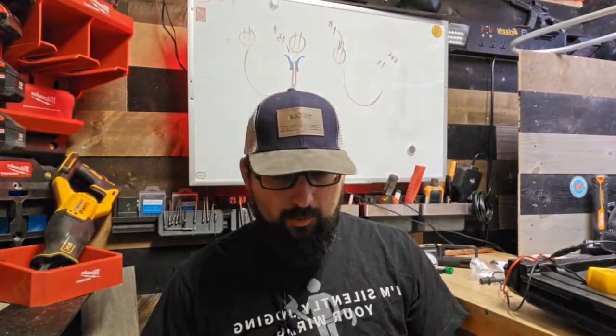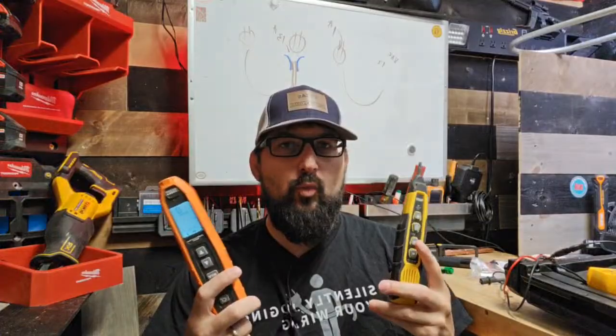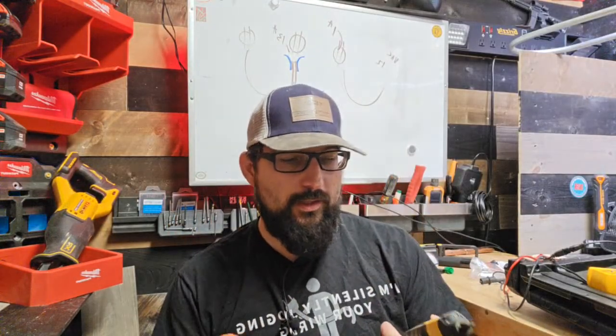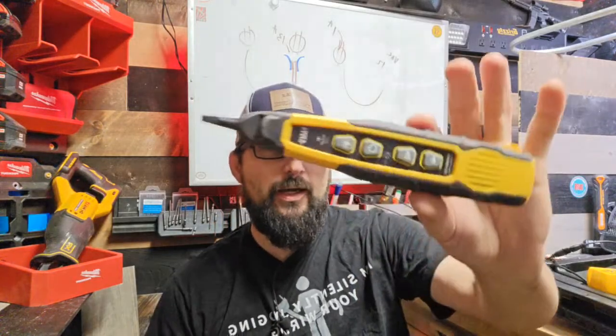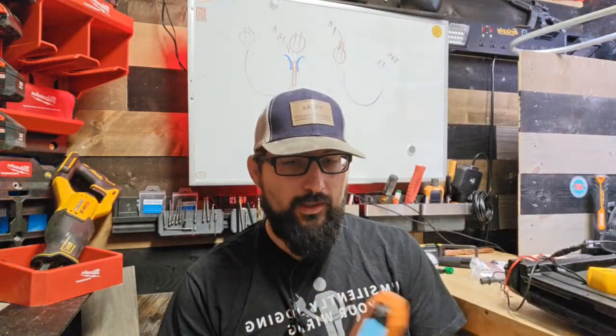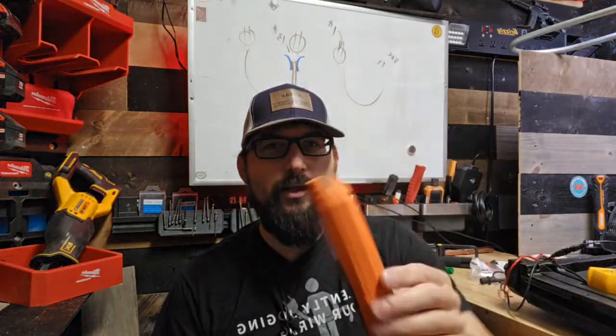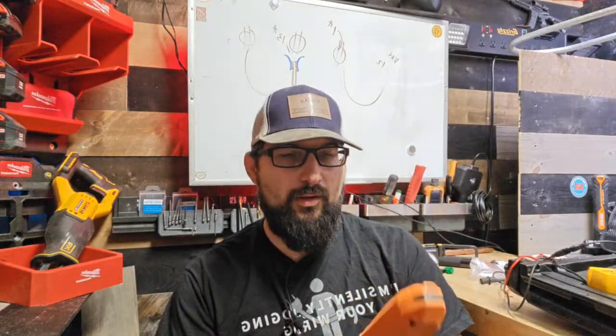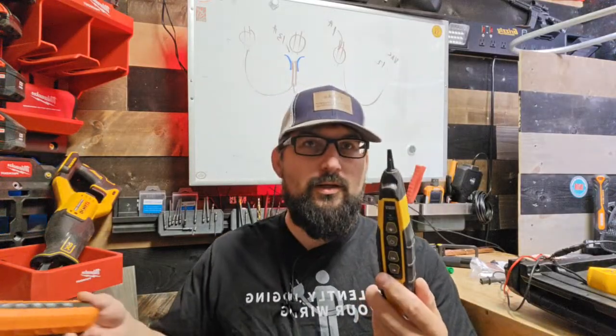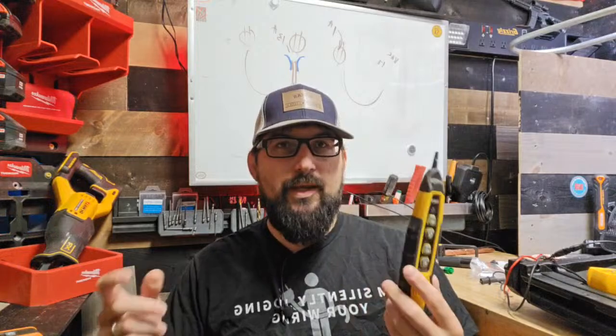So somebody asked a question today, which one to get? And the answer is, as a professional, you need both of them. This will get you by in residential for most of your career. This you're going to need if you're doing commercial. There's no doubt about it. Clamping to energized circuits in a crowded box and being able to read through EMT. And this thing reads through shielded cables, all that stuff. A toner won't read through shielded cables, and a toner won't read energized circuits. So that's basically it in a nutshell.